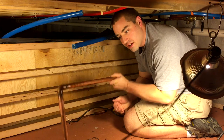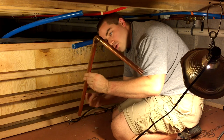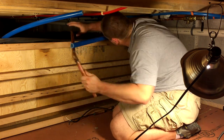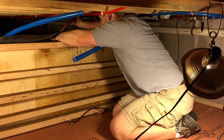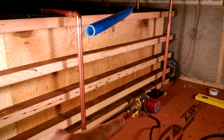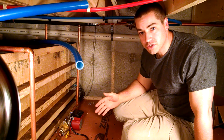We've got one more, and this is the dip tube. This is where the cold water is going to be drawn up from the tank. I already soldered this guy. The water is going to come out of that, down to the pump, and then up to the solar collectors. Everything is soldered together — it looks good.